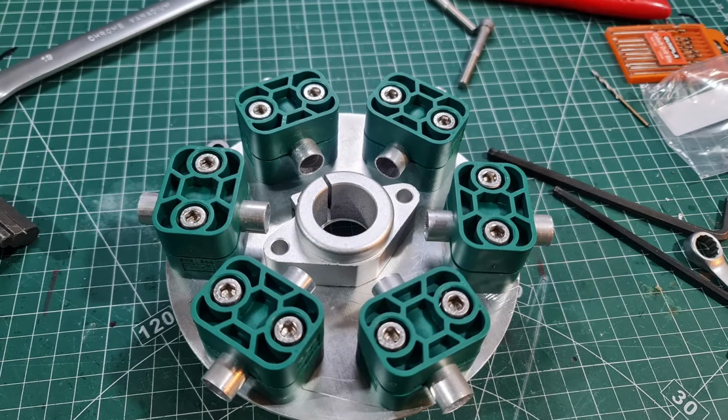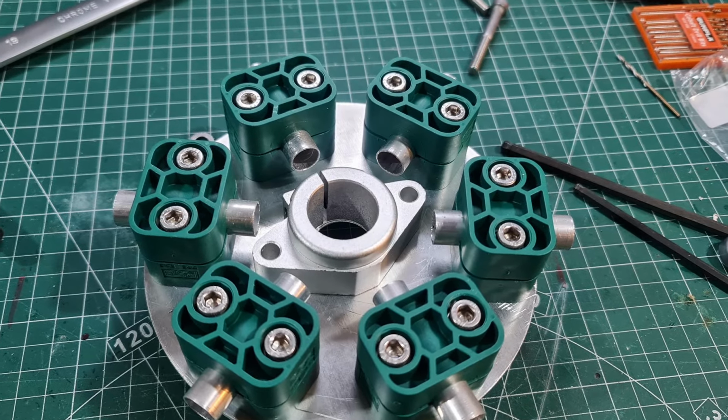And I'm only using one RSB hydraulic clamp instead of the two, because the spreaders are quite lightweight. They're quite easy to bend, because if you've got really strong, tight, tough spreaders, that's when you perhaps will bend that center plate with it only being 3mm thick. But you could thicken it up. I've just got a 150mm diameter plate, 3mm thick again, but I could have gone thicker. But I think it'll be okay.